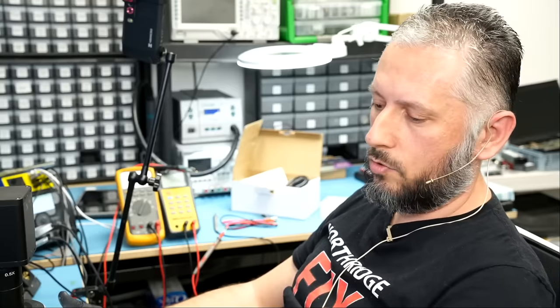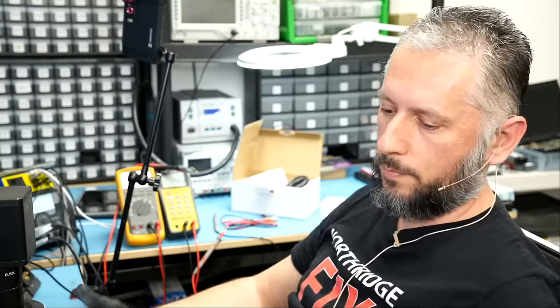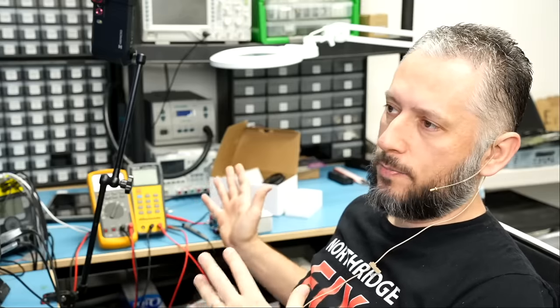In most cases, I would say 80%, 90% of cases, 1 volt is sufficient to be able to detect heat spots on the board. Now, one question you may be asking yourself is, why does this tool support up to 21 volts and 21 amps if we're only going to use 1 volt to inject voltage or 2 volts to inject voltage? Like I said, you do not want to inject more than 1 or 2 volts to any specific motherboard. You start with 1 volt and then you increase slightly until you are able to see a heat spot. Why does it support 20 volts or 21 volts if we're only going to use 1 volt?